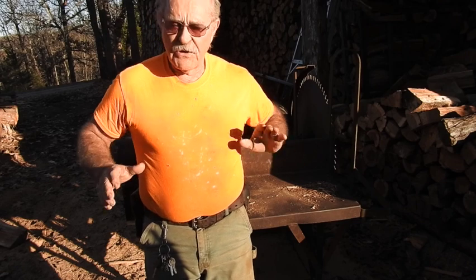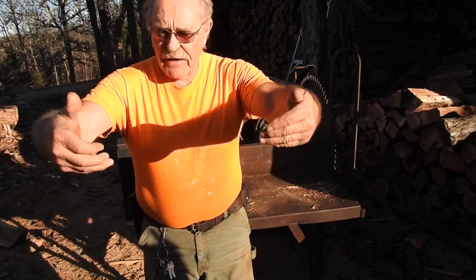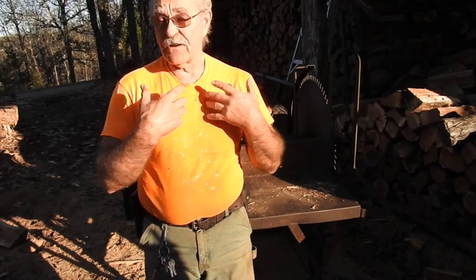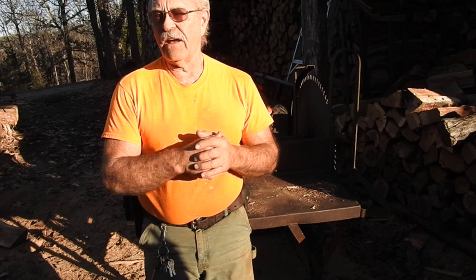But what you would do is you go ahead all the way into the cut, and when you're working with a second guy, those long slabs, you just hinge it up and then just go ahead and sever the last little bit that the blade doesn't reach through, and then go ahead and offbear. But that's the way you do it when you have two guys. That's the way we've always done it with two guys. By yourself on the wider ones, the jury's still out. There's not really a safe way or a good way of doing that.